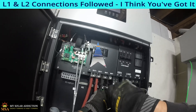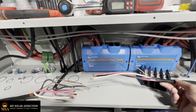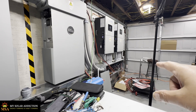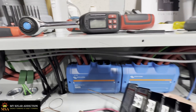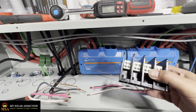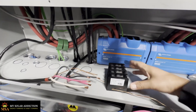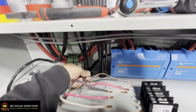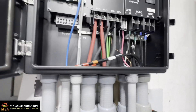We can see this is the 8-3 cable coming through the wiring trough, going around underneath my PowerPros all the way back over to where it comes in from outside. And that will be coming from the other power distribution block by the Solar Arcs that I'm going to be replacing that daisy chain setup with. All four of these wires will be connected on this side, and then each one — this one goes to this 18k PV, and this one will go to this 18k PV coming in right here. And we're AC coupling on the gen port.